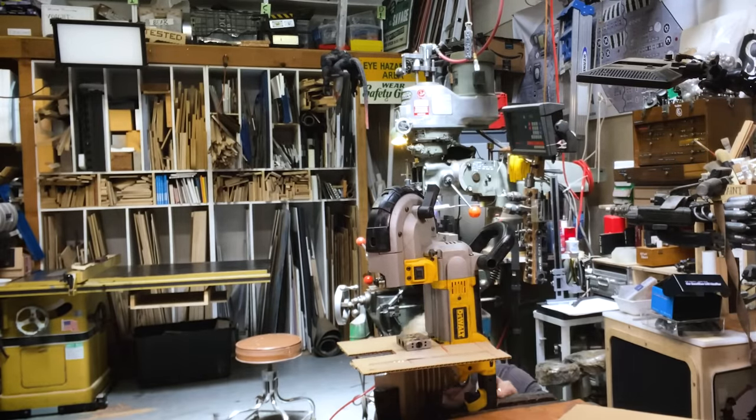All right. I don't just want a hole here. I actually want a little lip because I'm going to machine a plastic insert that sits in here, just like on a normal bandsaw. It might even be brass. So I'm gonna use this boring bar here, again, very slowly with lots of cooling fluid, and it's gonna be noisy AF in order to achieve this. Again, I'll be bringing it close and then using the Z axis, the knee, to bring the work up to the boring bar, rather than push the boring bar down into the work. So, locking. There it goes.